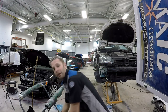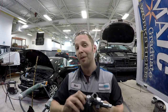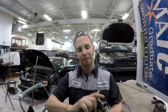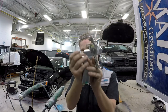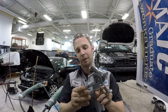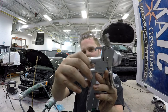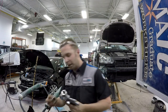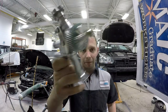Putting the gun back together isn't hard either. Simply you take your needle — first we put in our fluid tip because otherwise it will damage our needle. Here's our handy dandy spanner wrench. Give it a nice and tight, not too tight because you don't want to be fighting with it trying to get it off to clean it. Now you simply put your needle back in the gun. There's a spring here on the end of the fluid adjustment. Feed her right in. The status on this gun is this nice stop right here, so when you find out how much fluid you like coming out of the gun, simply set it there and forget it no matter how many times you take it off. Finally we put back on the air cap. That is basically the ins and outs of a spray gun.